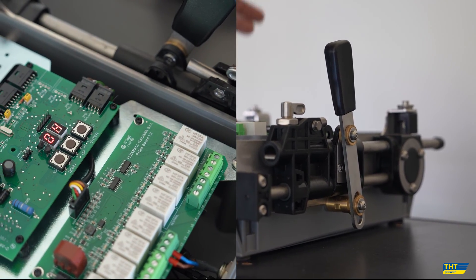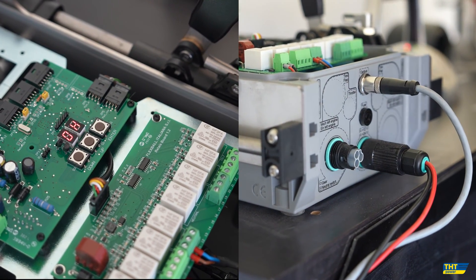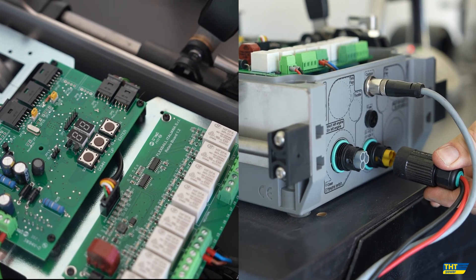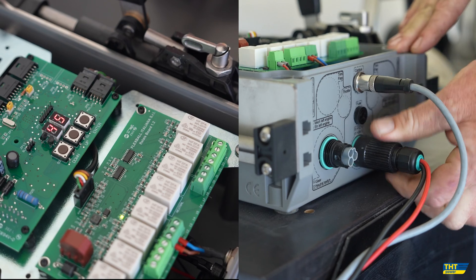To save all five parameters forever, pull out the power plug in the base of the actuator box, count to three, then refit the power plug and the system automatically goes back to the neutral and idle position.